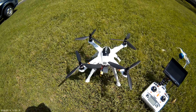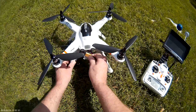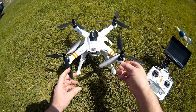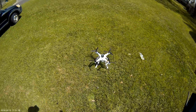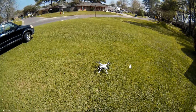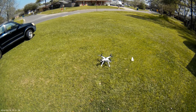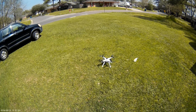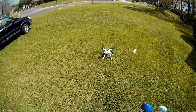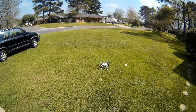I've already done the Compass Dance, the accelerometer calibration, and calibrated my transmitter to it. He'll have to do his own transmitter calibration when he gets it. So all I've got to do is power up and fly — just wait for it to get a GPS lock. This thing hasn't been powered up outside with the GPS plugged in for quite a while, so the GPS may have to do a cold start, which takes a little longer. It should get a lock pretty quickly now after we start up.